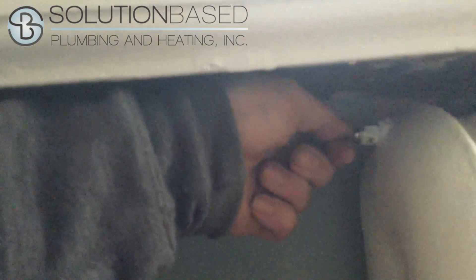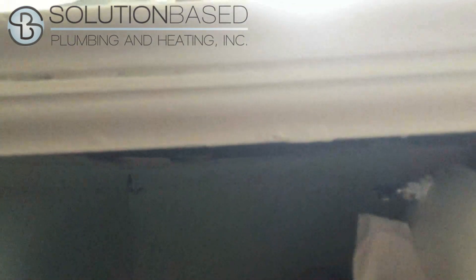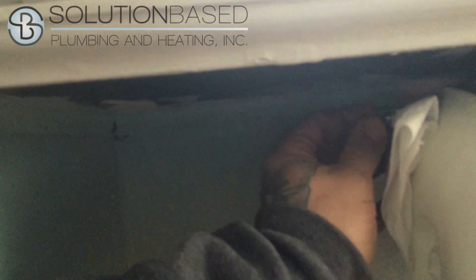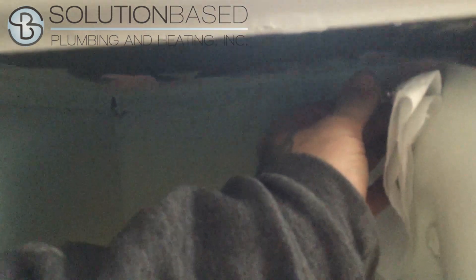As you can see, this water is running right down the rad and it's not able to go in the bucket. That is why I recommend having a paper towel — this way you can open and bleed the rad without getting water all over the floor, because often these are painted over and pointed in the wrong direction, and all manner of things that make them difficult to bleed without making a mess.